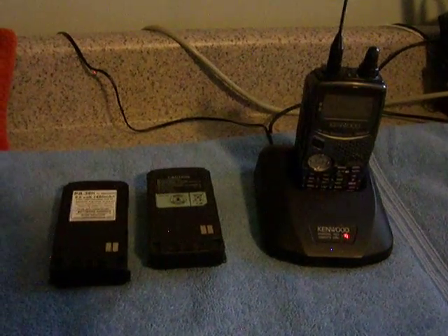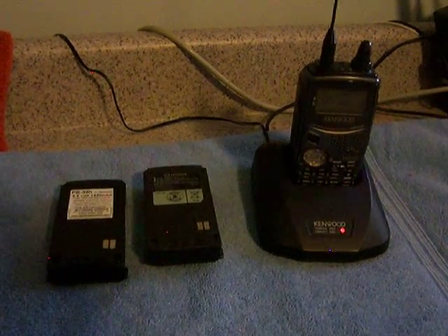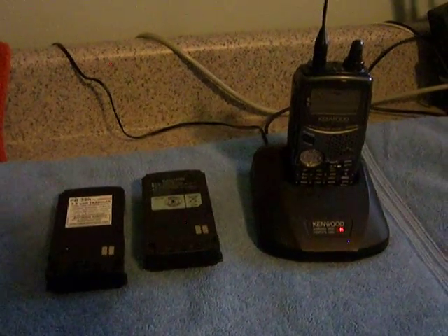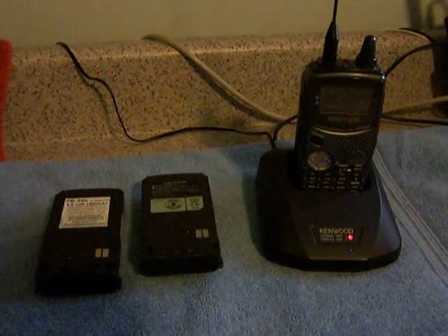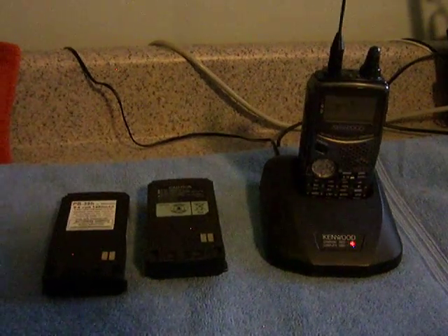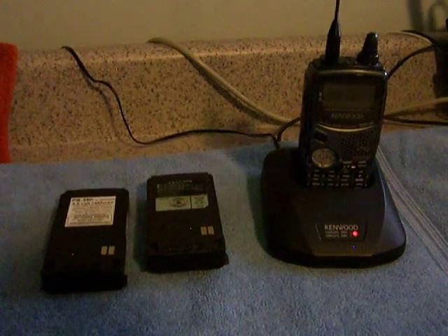You can connect a GPS to this. What's really nice is the G version — which this one is — can do the Kenwood Sky Command system 2 Plus. If you've got a TS-2000 or other select Kenwood radios, it will let you remotely control the base station's sideband HF, UHF, and VHF from this HT. Some options: 200 alphanumeric memories, APRS, takes 13.8 volts via the side jack, DTMF memory, built-in TNC, Sky Command system 2, and dual frequency receive.